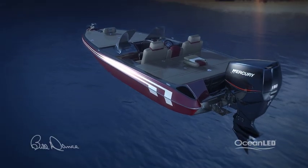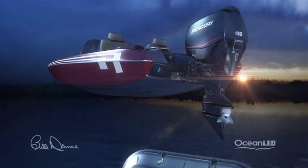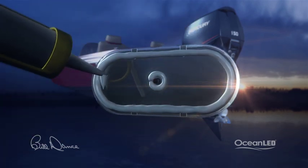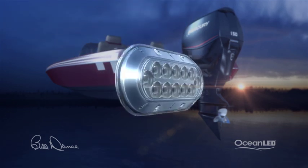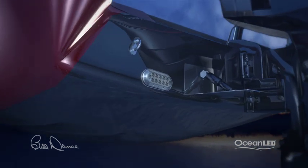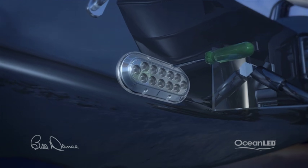I recommend two to four lights to create the best effects, and it's important to space them evenly. All models require only a half inch hole in the hull to pass the power cable, ensuring there's a full coating of marine sealant on the reverse. Now the light is ready to mount. The light can be mounted in any orientation to suit hull shapes, obstacles, and exterior styling. Secure in place with a few stainless steel screws and you're ready to go.